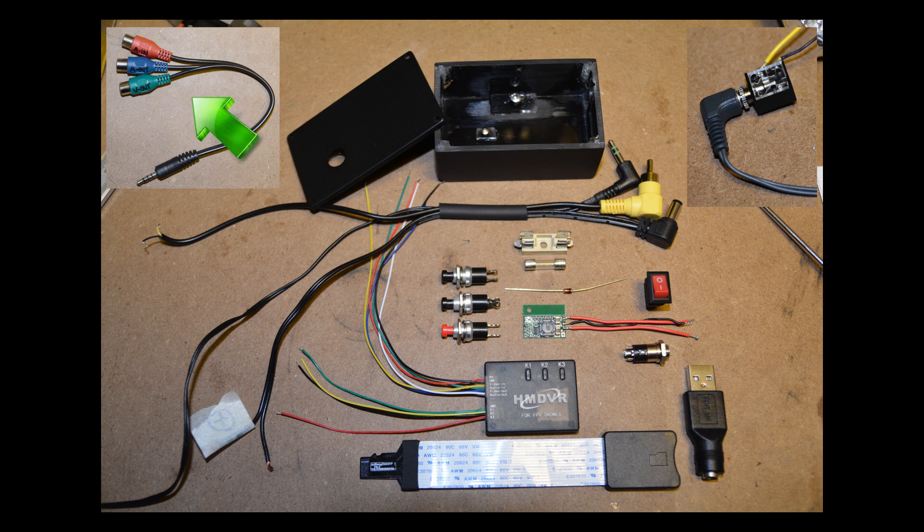If you want to use the video out, audio in and out, you can get a 3.5 jack to 3 RCA female adapter cable. And of course the actual housing, made from 3 millimeter acrylic sheet, glued together with acrylic glue, then drilled and painted. Here are the specs of the housing.